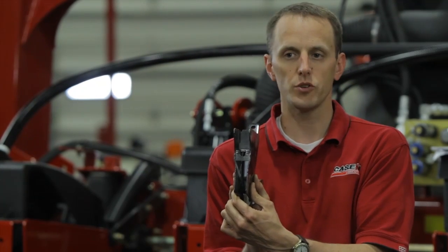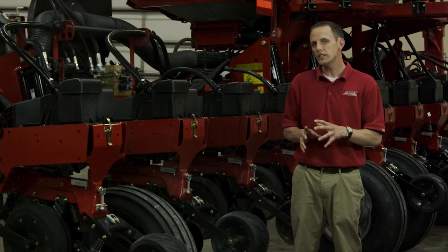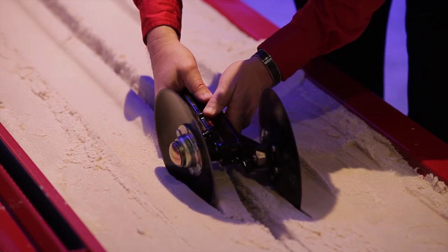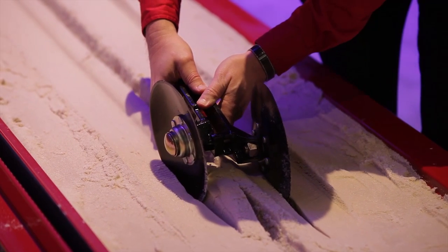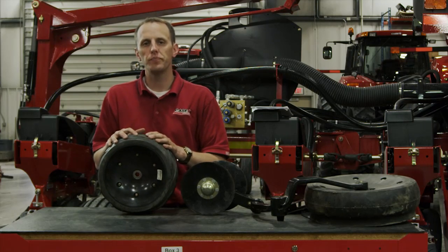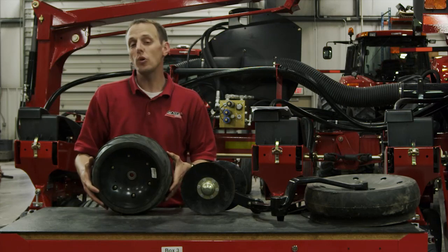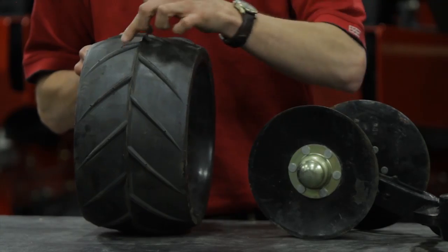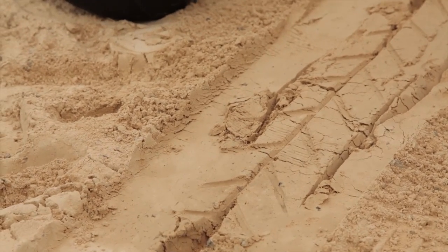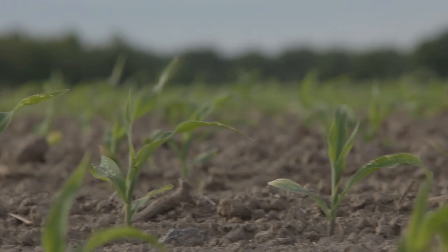The seed shoe is there to protect the sidewalls of the trench so the seed can fall in properly. The back of the Early Riser row unit features a dual-stage closing system to cover the seed and provide perfect soil pressure on top of it. The first stage is the inverted closing disc, which places the moist soil retained by the gauge wheels back on top of the seed and gently squeezes the trench closed. The second stage is the press wheel, which presses soil down to give uniform pressure around the seed for perfect germination. The press wheel also has a rib through the middle and spokes off the edge that crack the soil if it crusts, allowing seedlings to emerge evenly — creating that photocopy plant throughout the entire field.